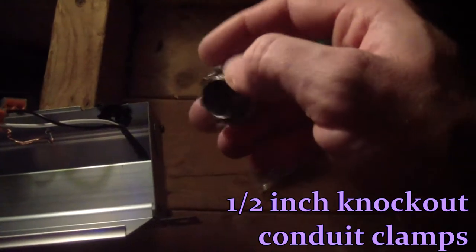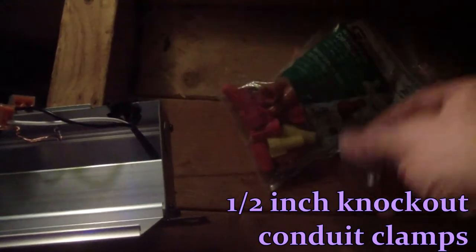I got the second light in there. I just want to point out — I turned off what was labeled the master bathroom and master closet switch, and this did not turn off. So always verify that you've actually turned off the power. Also, something I forgot to mention: you need a knockout ring that looks like this to clamp your cable going in. These have two optional knockout holes, so position it how you need to.